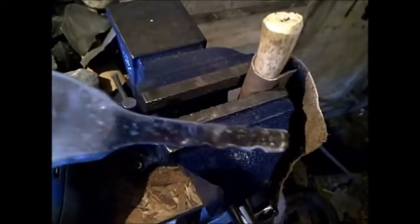I cut the tang down so it's a rat tail basically, and I put these grooves in it because I'm going to drill out the antler so the blade will fit right down in through there until it bottoms out. Then I'm going to epoxy it in, and that's why I have the grooves — so it will hook into the epoxy. Right now I'm drilling down through the antler making a slot so the blade will fit in nicely.